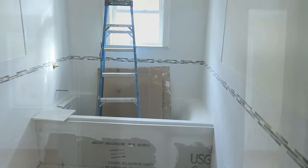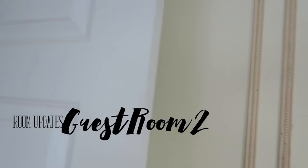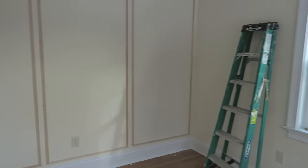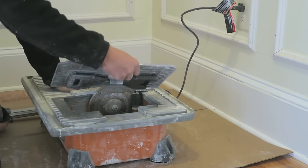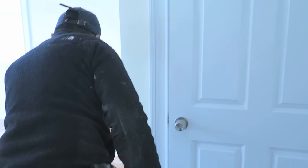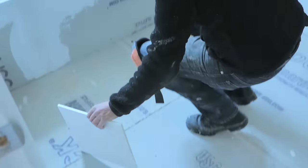Chris already finished up with this room — it's really simple. We used what we had left and just added a border frame. We're going to add a medallion to the edges and call it good because it's really time to move into the new house now. Before we get started we have to make sure the machine is calibrated and there's enough water in the wet saw so it will cut the tiles nice and clean. Before tiling, I had to lay out the bathroom so it looks nice and uniform and I don't have to cut a small piece towards the edges.